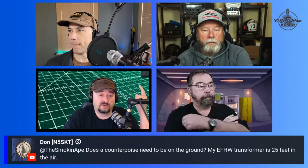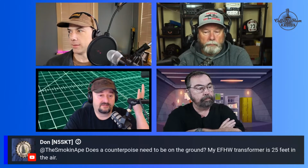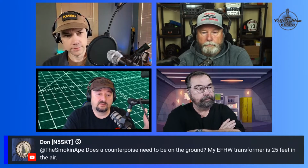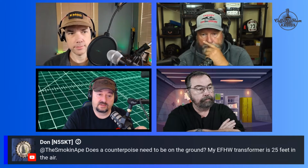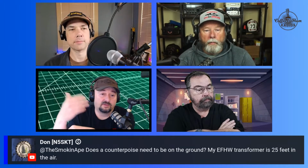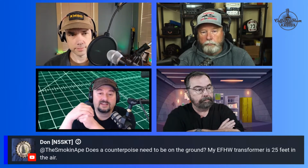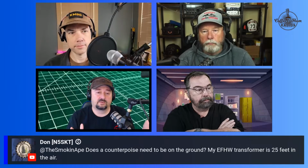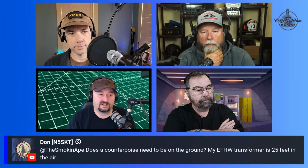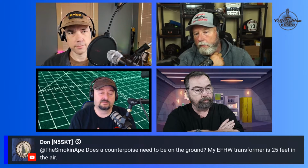It's going to depend a little bit, right? I had a 9-to-1 that was like 15, 16 feet in the air, and I put on a counterpoise that wasn't on the ground. It just hung straight down. Now, if I'd used my coaxial cable shield as opposed to the counterpoise, well, guess what? That ain't on the ground either, so you have this same situation. Now people say you can tune that because it's an elevated counterpoise, and you should tune that because it becomes part of your aerial system.